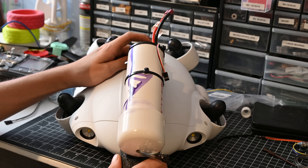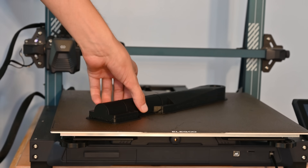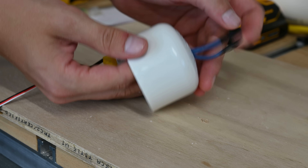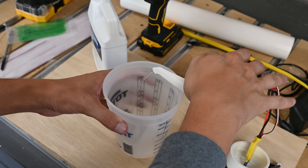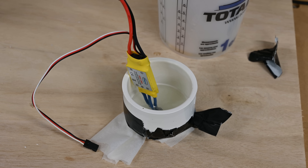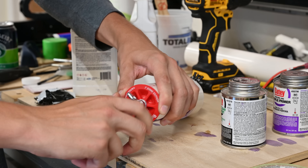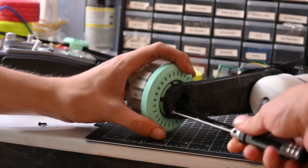My goal is to mount the motor to this drone and then take it as deep underwater as I can go. I used my biggest 3D printer to create a giant arm which will attach the motor to the V Evo. To power the motor, I used a piece of PVC pipe cut down to length to create an electronics pod. I drilled a hole in an end cap, passed some ESC wires through, and filled it all with epoxy to seal it. After it dried, everything got glued together for a waterproof connection. The other end just gets sealed with an expandable cap — once it gets down to depth, there should be about 40 psi of pressure trying to get into this pod. The electronics pod then gets attached to the bottom of the arm using zip ties.